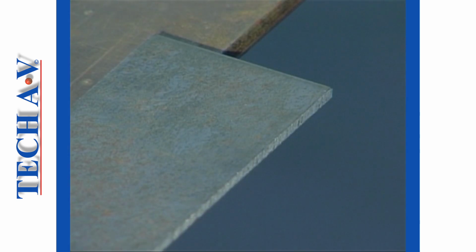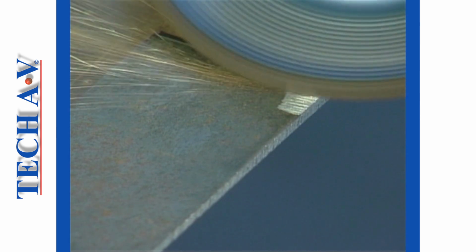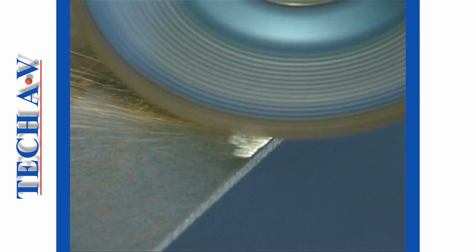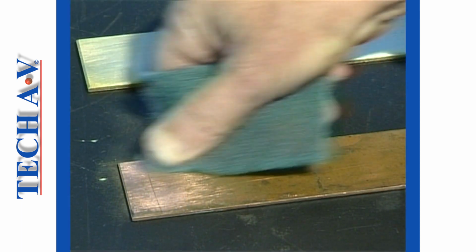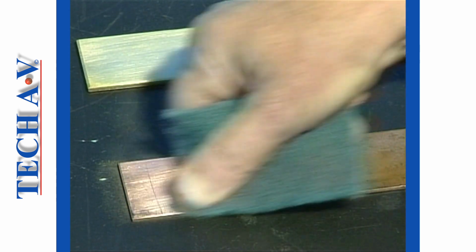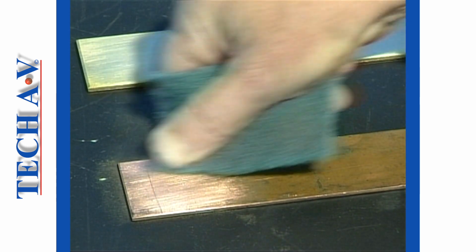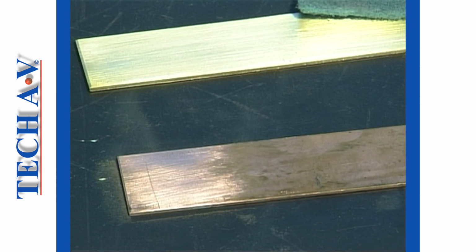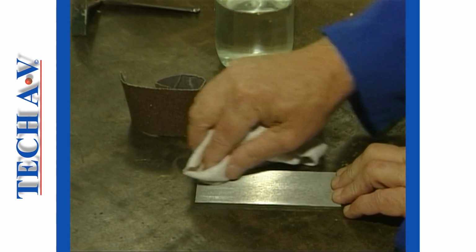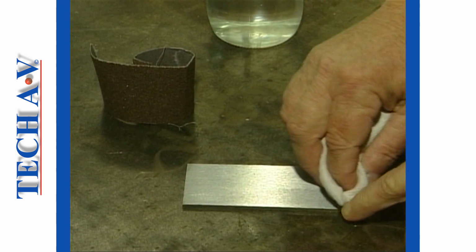Metal oxides, such as rust in the case of mild steel, should be removed by sanding or even machining where necessary. Non-ferrous metals like copper and brass rarely need heavy sanding or grinding. Mechanical cleaning of copper and brass is most usually effected using a scouring pad. After grinding or scouring, further cleaning with a degreasing agent will be necessary to remove loose particles.